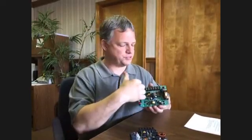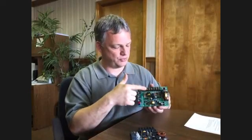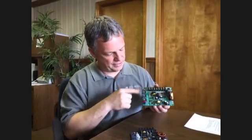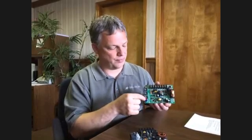The identifying features: this is a rather compact board, kind of a small rectangular layout. You'll find most of them out there without this coil on it, but it'll be the same basic layout. You'll see this terminal strip along the top, these fast-on type spade connectors along the middle here, and a few connectors up here, and of course the display jacks on the one side along with the blue and the red jack here for the different applications.